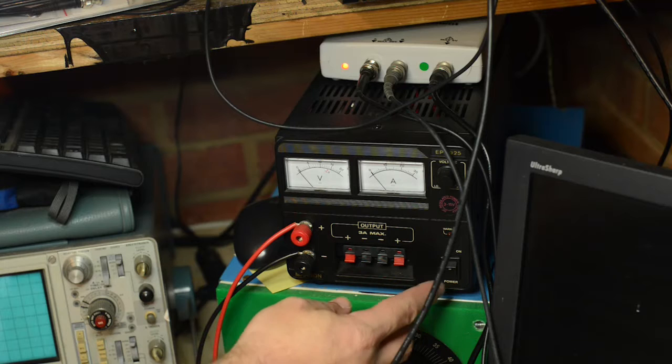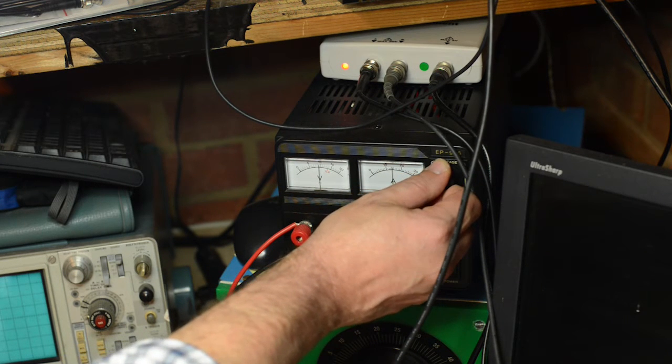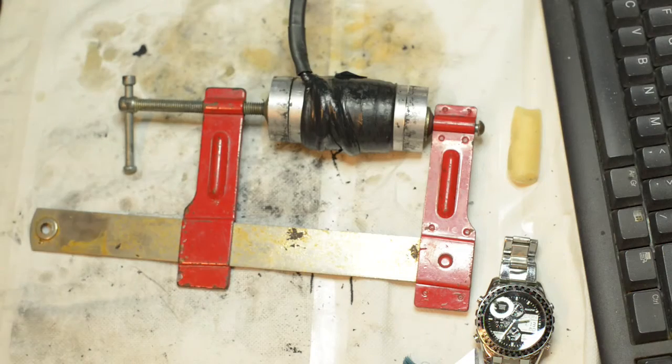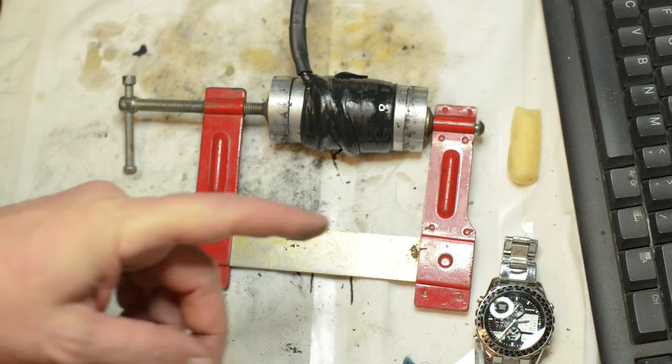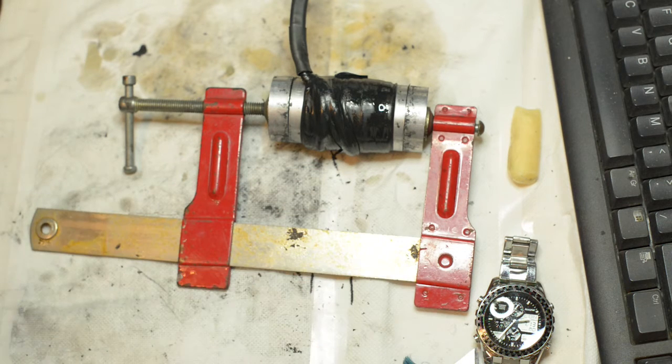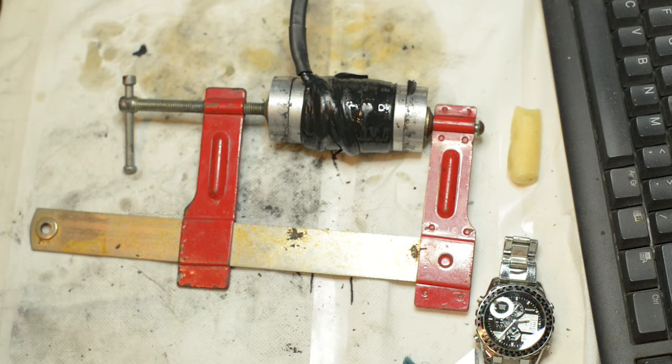During the first 1.5 to 3 minutes of the curing process, 10 volts at 15 amps will be applied to the coil. The external temperature of the mold should rise to about 80 to 85 degrees centigrade. During this time, the viscosity of the mixture is rapidly changing, and it will eventually seep through the gaps between the main mold body and mold end caps.